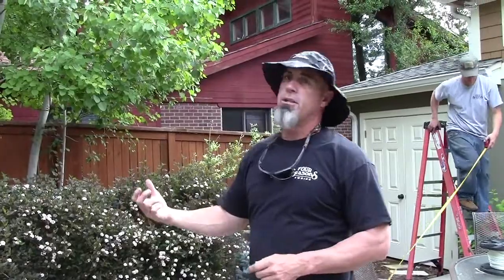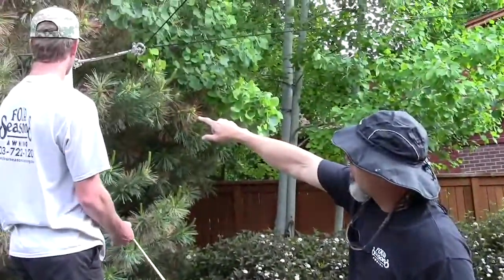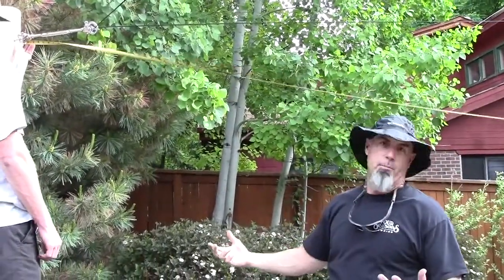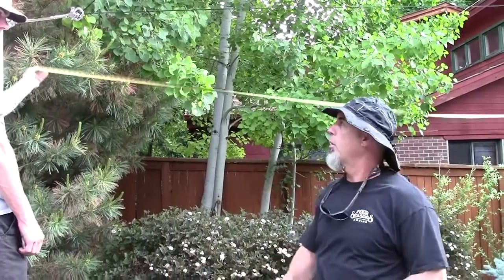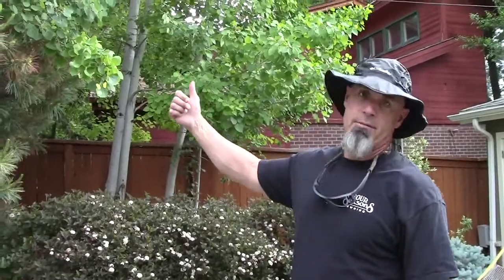The other option, if you do not have the hardware up, is to measure from basically the attachment point, which is either going to be an eye bolt or, you know, a bracket maybe that you've purchased online somewhere, but you're basically going to measure to that exact same point around. And if you're using a single turnbuckle, we're just going to want to know what corner you're planning on installing that turnbuckle, and we'll make that deduction. There's usually three sizes of the turnbuckles. You can have 8, 10, or 12 millimeters. So now that we have this measured, we'll go through the installation process and getting this strung up.